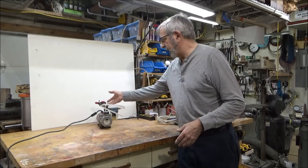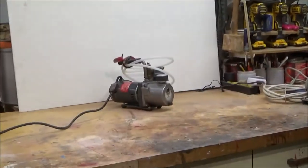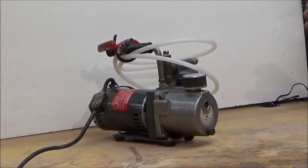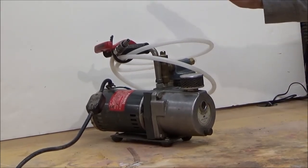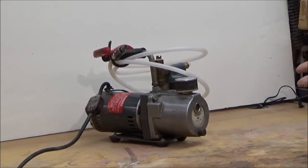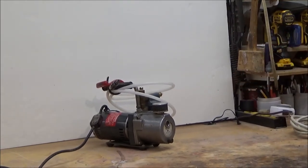The first type is the small pumps you typically see used for HVAC applications. This is the pump I use for my vacuum stabilization chamber. It's an oil bath pump with an eccentric cam embedded in oil. It's only a tenth of a horsepower — it doesn't provide much volume of air, but it provides a very high vacuum. That works great for vacuum stabilization where you're not moving a lot of air, but it doesn't work very well for a vacuum chuck system where you may need to move a higher volume of air.